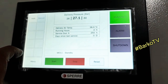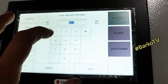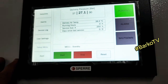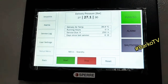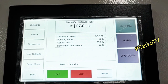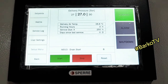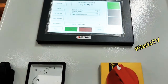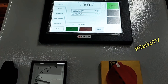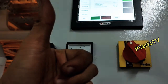Now we have already drained. We need to check the cut-in. Pressure drops to 27 — the compressor must run or must start automatically at 27 bar. Drain valve activates — that means it is good. Our compressor is running. We already checked the cut-out, now the cut-in is also checked. Sensors are working good.